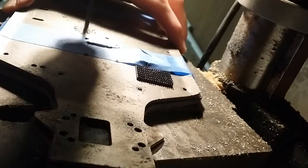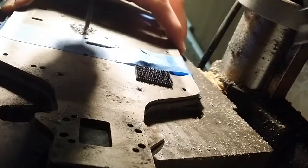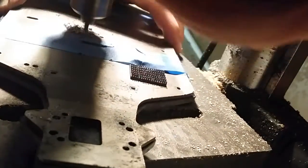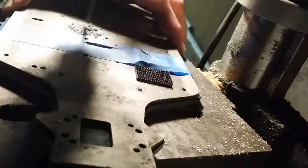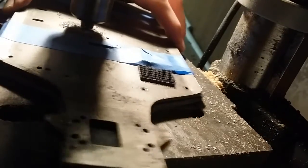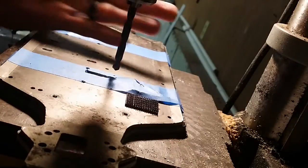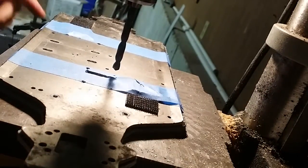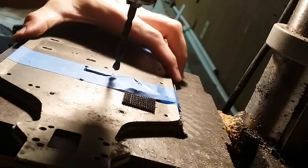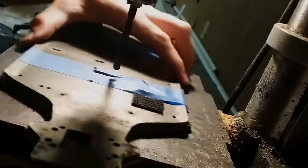We'll just have to fill a couple of holes here, one at each end, and then push to connect them — now we have an entire slot. Next up for the spur gear slot we are out of our numbered bits, so now we're going to use a standard quarter-inch bit. Same deal here — we're going to drill a series of holes all the way along and then just drag it across.